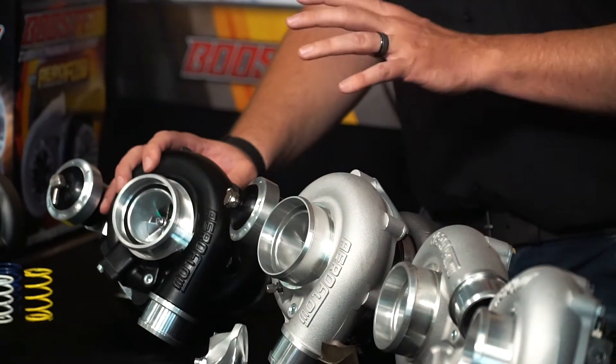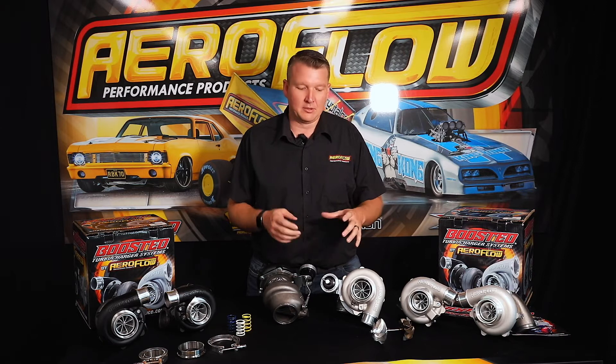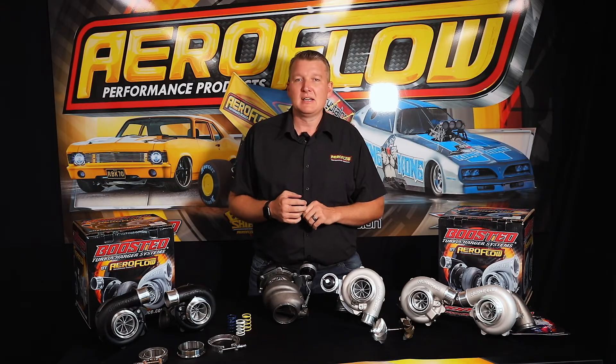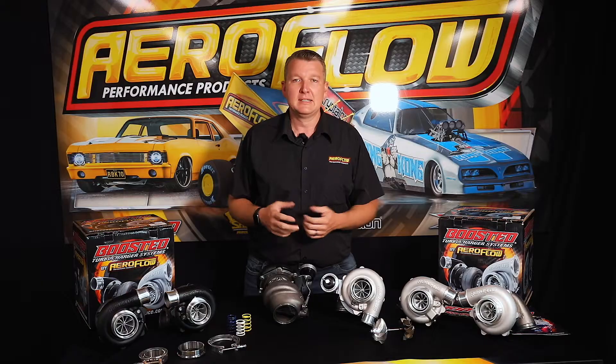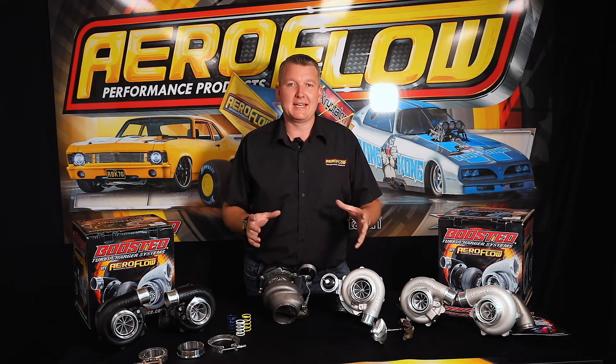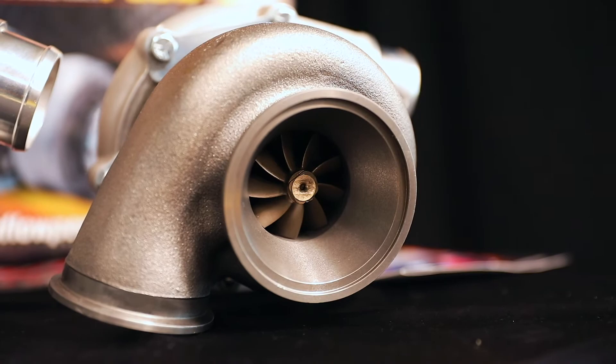With point milling, not only does it increase performance and efficiency in the turbocharger, but there's a lot of extra work involved. When you're talking about all that extra milling on the leading edge of the compressor blade, a flank-milled wheel takes roughly 15 minutes in the CNC machine, whereas point milling takes anywhere from one to two hours depending on the size of the wheel. That's often charged as an upgrade by others, but it's a standard feature on the Boosted Performance turbochargers — a value add that gives our customers more bang for their buck, which really is the point of these frame turbos.